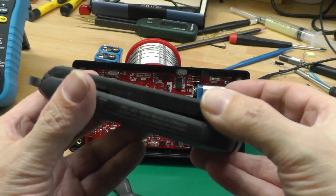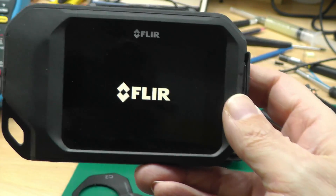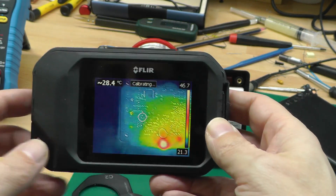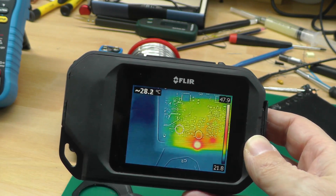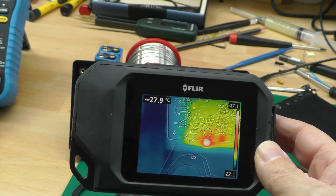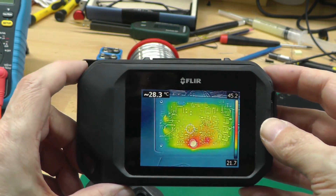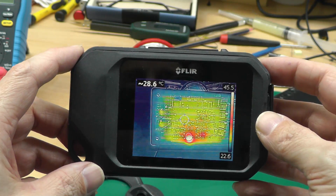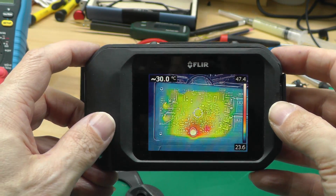The assembly's back together enough to give it a test — let me power it up. The PDV-S2 is still on. Well, it's obvious what's happened: I've gone a little too far now and the IR image is well below the LM399, so I've just got to reduce the height a little bit. Let's get back into it again. And there we go — a FLIR C2 optimized for about six inches away from the subject. Having moved the lenses they'll be no use for any distance work, but for circuit boards I think that's just perfect. Five-minute modification — thanks for watching.